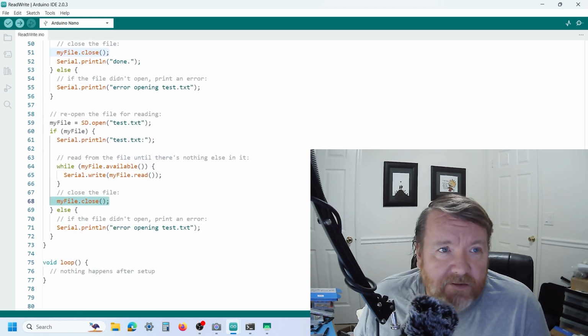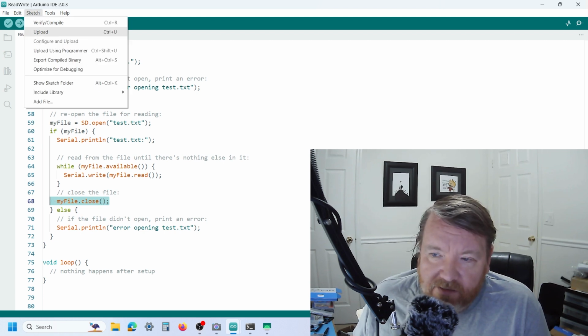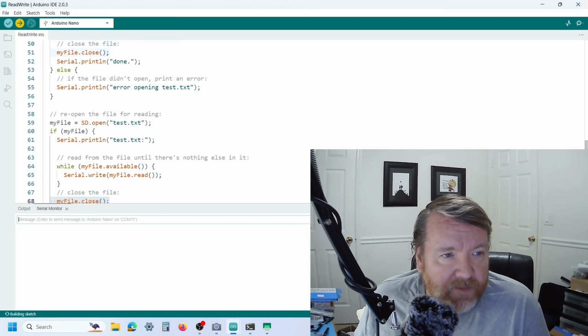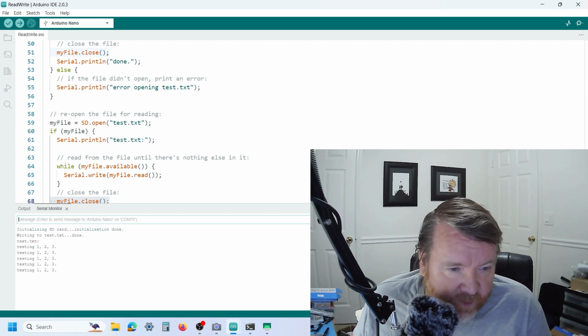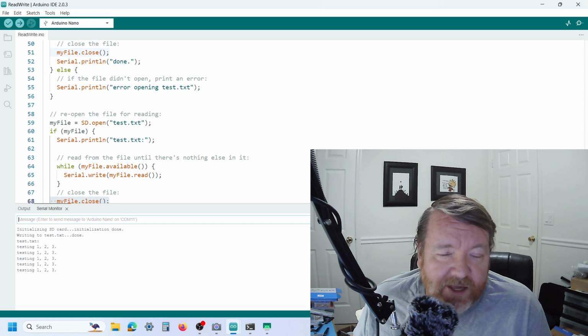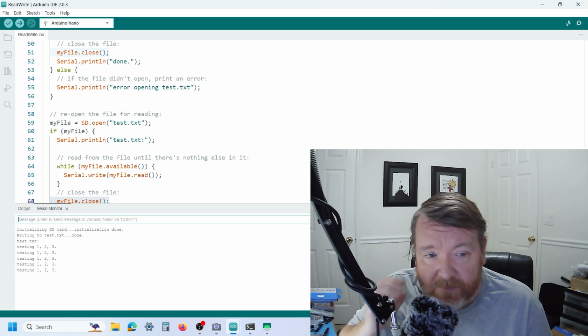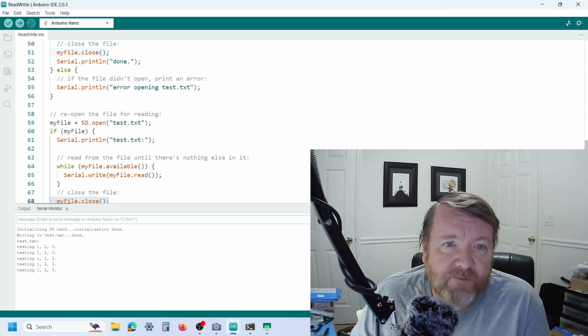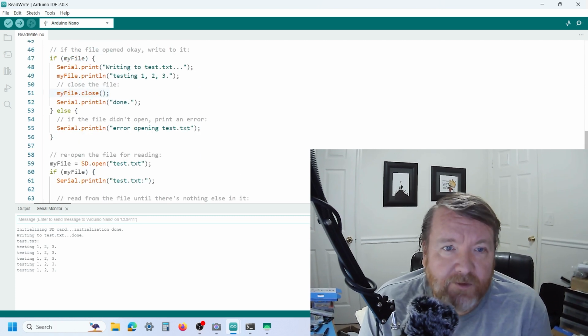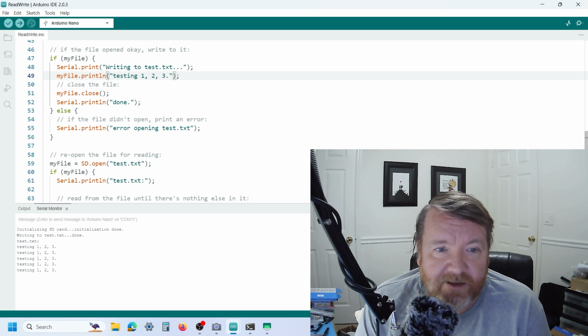So let's try and just upload this sketch. We're going to look at the monitor and see what happens. And there we go. So writing to text file is done. Now, as I said, I've run this a few times, so it's written the statement now 1, 2, 3, 4, 5 times. So it keeps appending to the text file, and then the final statement reads from the file, and it's done. So just to prove 4, 5, make sure it's actually reading.